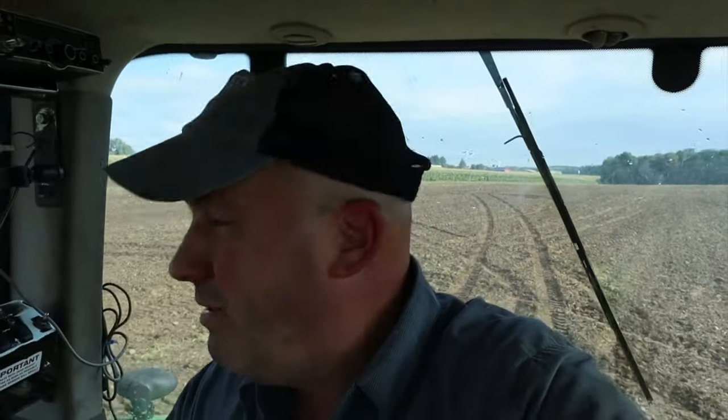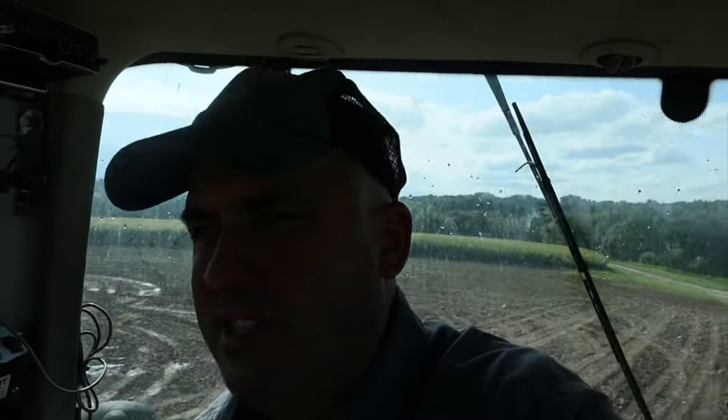So, I am down in behind the old heifer barn on the old side of the road here, just running this 7200 around in circles to try to get these wheels to seat in, to get that wedge setting into place where it needs to be in the wheel. Once we get this back up to the shop, we'll retorque the inner wheels. We'll get the axle mounted hubs put on, and then we'll put the duals on there, and we'll be able to finish this job up.